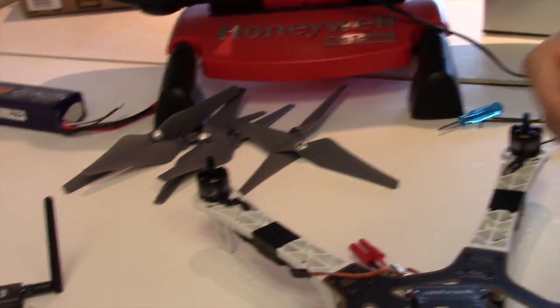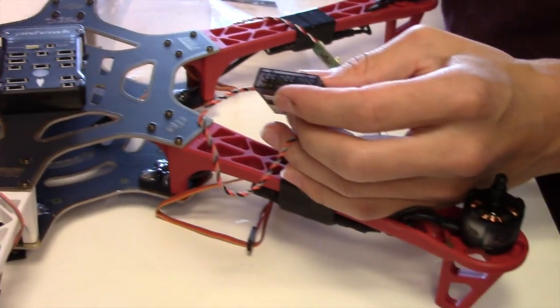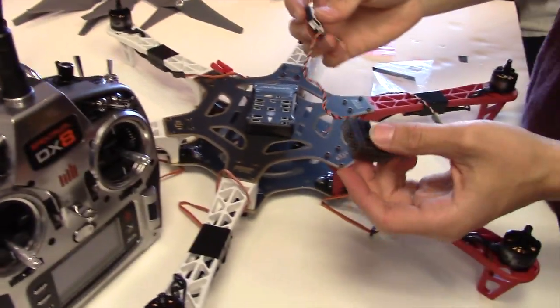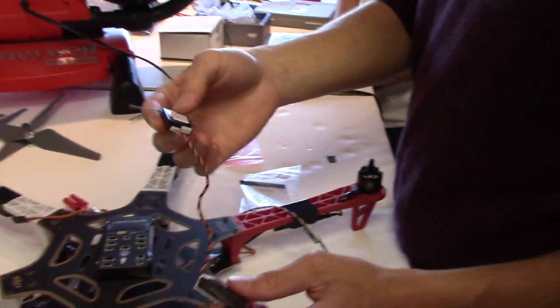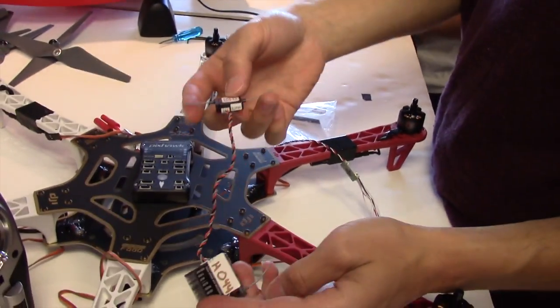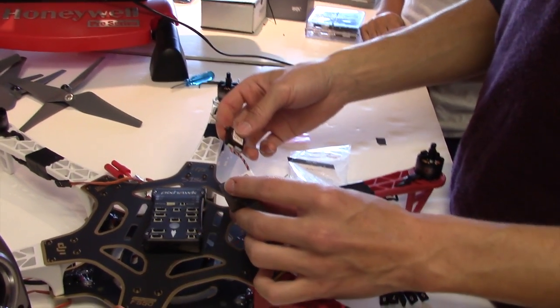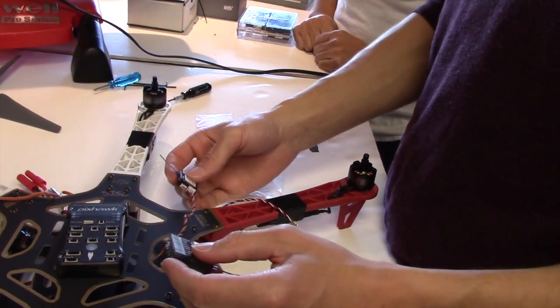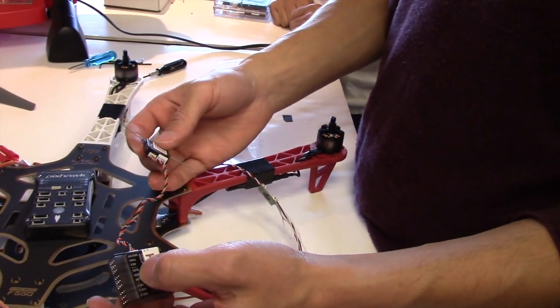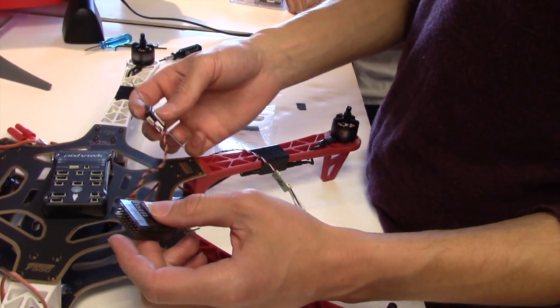In the meantime, this RC receiver here is going to receive the signals coming from the little handset, the manual controller right there. And there's actually two antennas, well, almost three, but two antennas on this thing. One here, and then one here. We're going to put them on different places on the vehicle, so that this box here is going to choose whichever one has the strongest signal and use that to take the input forward. So it makes it a little more robust.